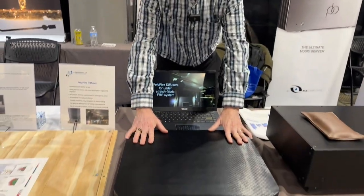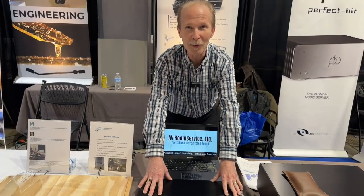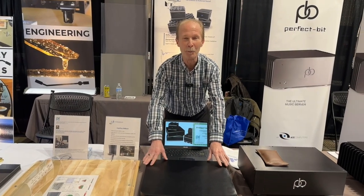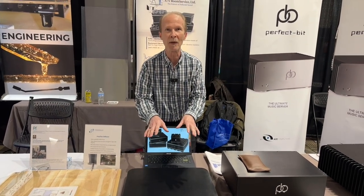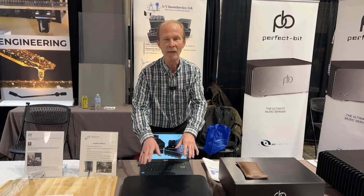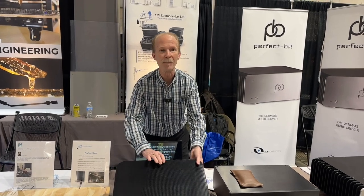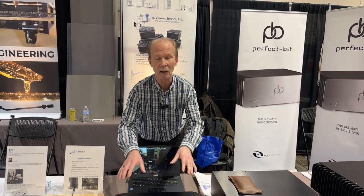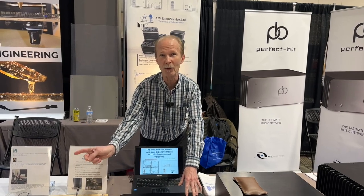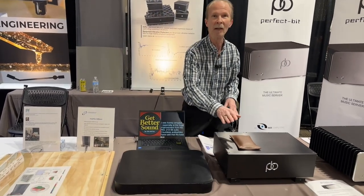Then we've got a couple of prototypes. This is a real rough prototype — I put it together just the day before leaving for the show and vinyl wrapped it. But the concept is: if you've got a turntable that is more than one piece — maybe a separate motor and tone arm — it's difficult to isolate well, you need a platform. This is going to be a constrained layer damping design with rubber on top and then a vinyl-wrapped, inexpensive, lightweight plinth that'll hold hundreds of pounds. You put three EVPs under it — a simple solution for a multi-piece turntable for isolation.